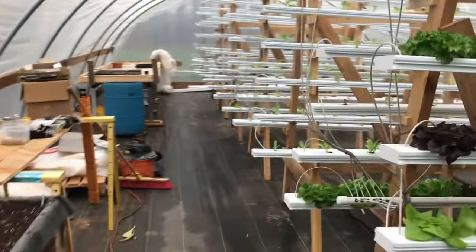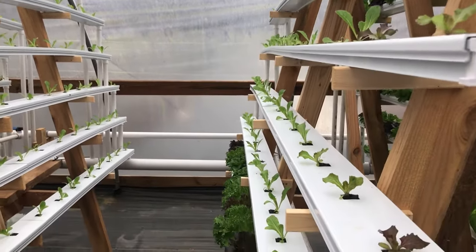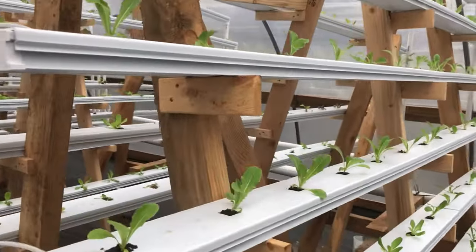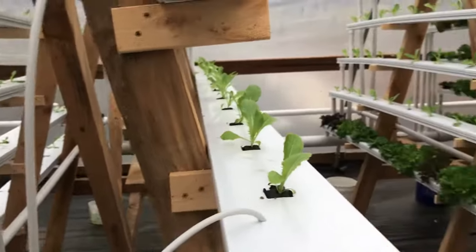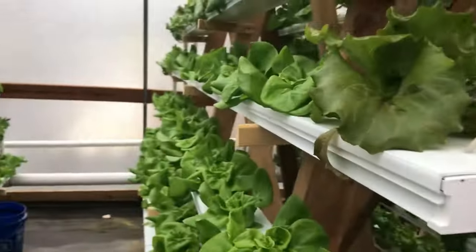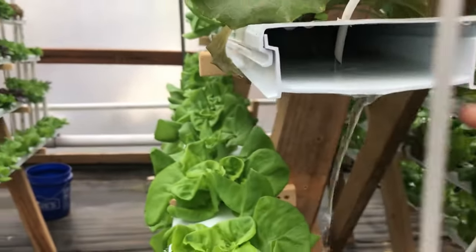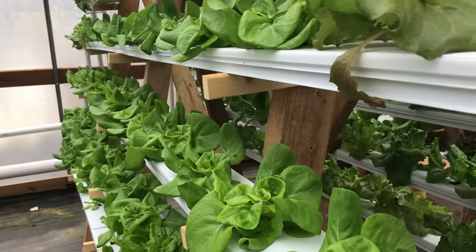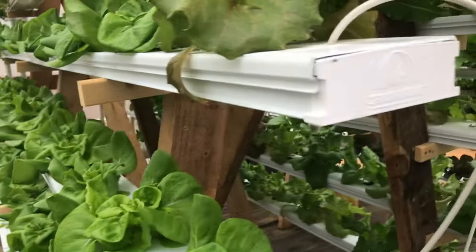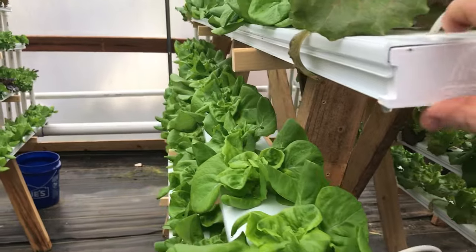We still have a number of troughs that have not been planted out yet. These troughs were planted out about a week ago and the plants are doing really nice. There are a few that didn't make it because the troughs weren't quite level enough, so the water didn't run down the middle of the trough. If I open up the end of one of these troughs, you can see the water is running down — it's a bit hard to see because it's dark, but the water runs down the middle of the trough. Some of these still leak because I have not put silicone on the end caps yet, and this one looks like I'm going to have to.